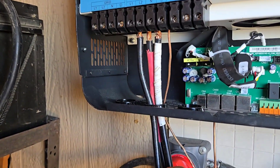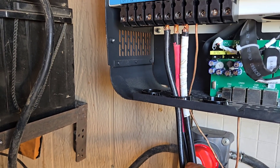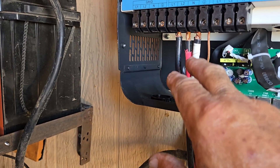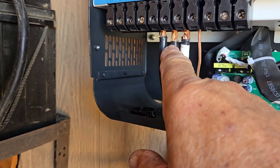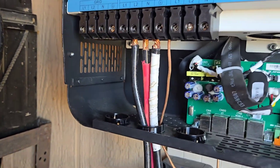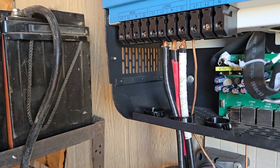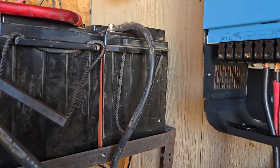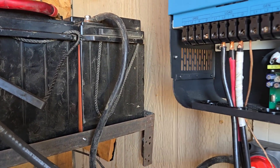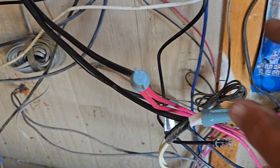The only issue is I only had number four wire and I actually need number six — the four is too big. So I had to trim a few strands off the wires to fit them in, and they're not seated all the way in like they should be. I worked them as tight as I could and locked the screws down — it'll work for the night. Tomorrow when I go to town I'll pick up some number six; looks like I need about six feet of it, and I want a junction box down here for all these wire nut connections.